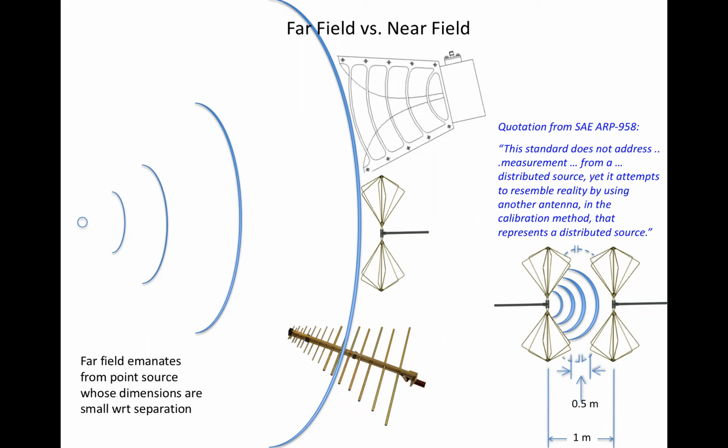It is not a value that can be scaled with distance like a far field measurement. The "field intensity" so measured is only useful to the extent that the limit was based on that specific measurement, the measurement simulates the actual RFI problem the requirement attempts to control, and, most importantly, everyone does it the same way. This is why, for instance, MIL Standard 461 RE102 specifies antenna type and size, and why, in my opinion, RTCA DO160 and CISPR-25 should follow suit.